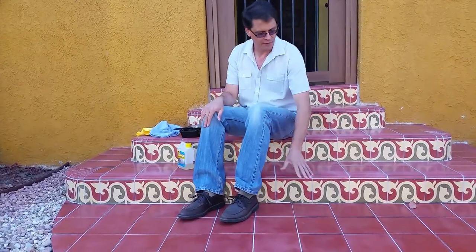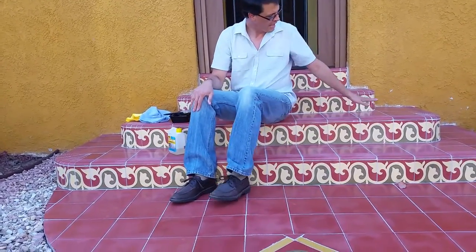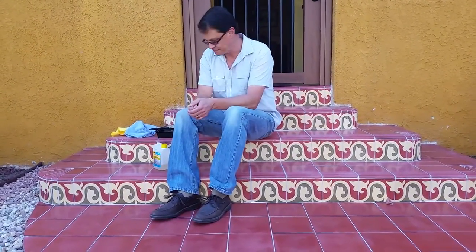We've already done a single coat of stone-enhancing sealer here, applied just a day ago. This tile was sealed about a year ago with a Fila FOB, a solvent-based penetrating sealer. You can see the difference — a nice rich color that's been enhanced with the stone-enhancing sealer, whereas over here the tile starts to look a little less bright. So we're going to apply another coat of stone-enhancing sealer. They're both penetrating sealers and both protect the tile from staining and water.